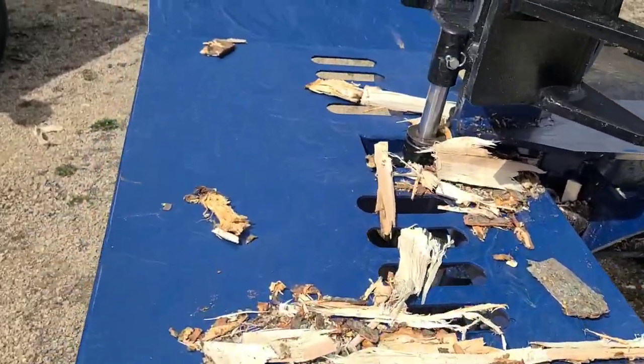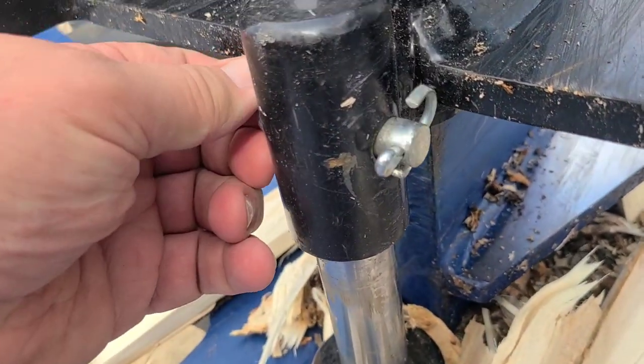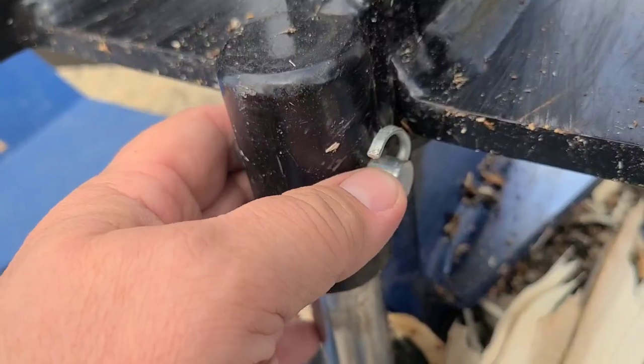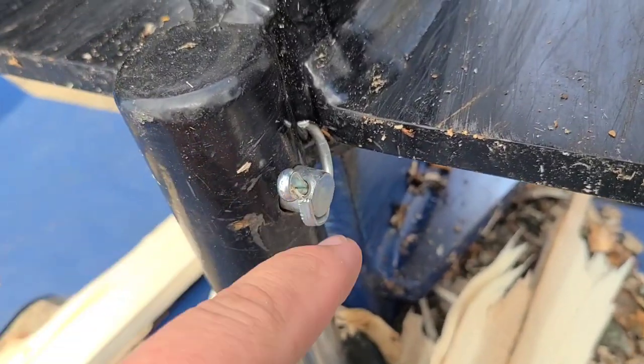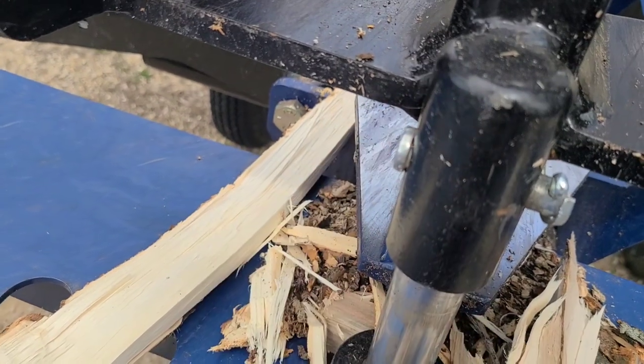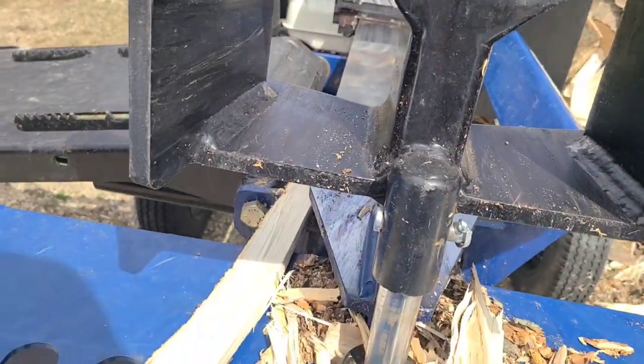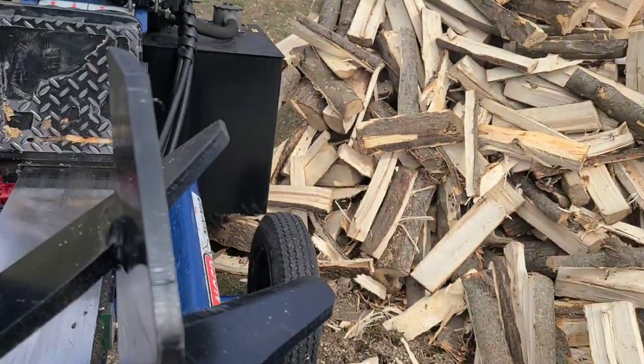And we're back to the present time, a week or so later in real time from that video clip. Take a look — oh, the sun is blinding everything — and how well that has held up. So far, so good. I am liking that a lot. All I have to do is take the pliers and just bend the buggers out of it. This way I can keep the wedge at the height where I want it — that's the whole reason for the pin to be in there. The wedge height doesn't change on me. I don't mind if it floats running the four-way doing regular wood, but when running the 12-way I wanted to keep it more consistent. Now that I know it works, I'll do that on the four-way too.